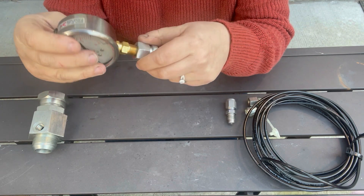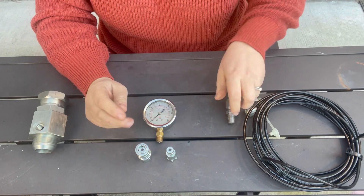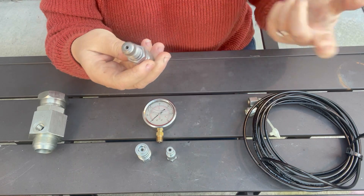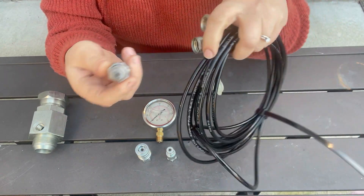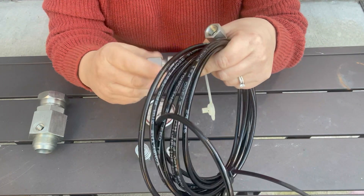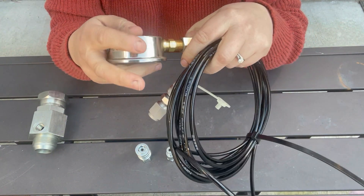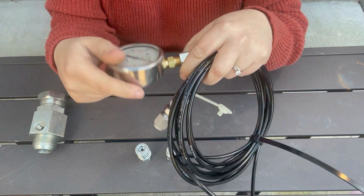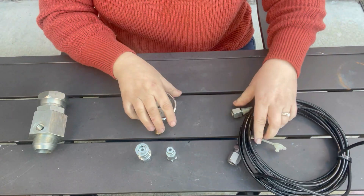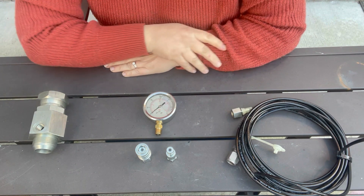The third method, also mostly seen on pumps, is the micro bore hose assembly. You can see that little port sticking off of your pump — usually it's covered with a metal cap — and it's designed to take the micro bore hose thread. You screw that in, and this hose is super long, though they make them in different lengths. The other end is a quarter inch female pipe thread for your gauge. So there you have it: three different ways — the micro bore hose assembly, PD style quick coupling, and the gauge port T. Thanks for watching.